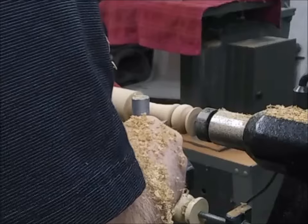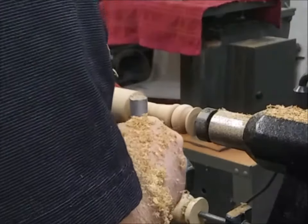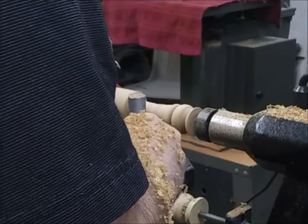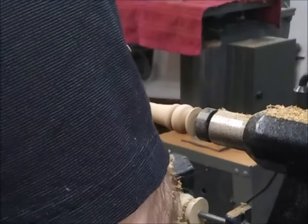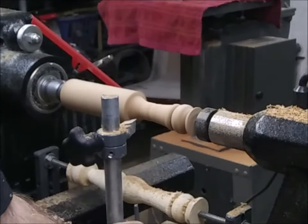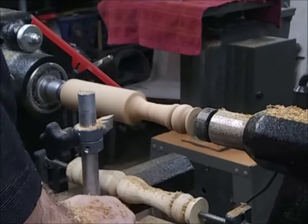Red oak is fibrous, so I'm going to have to sand a little bit more than I would with cherry, mahogany, or walnut. But it doesn't take too much, especially if your blade can reverse — you can go ahead and knock the fibers off in both directions.